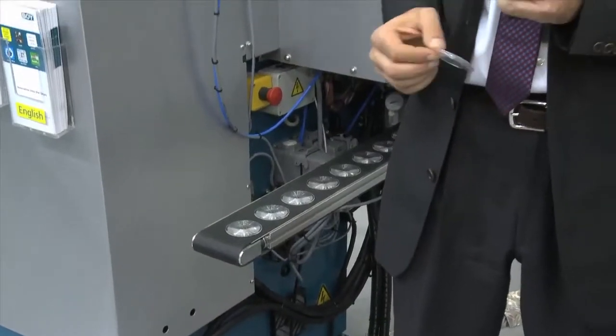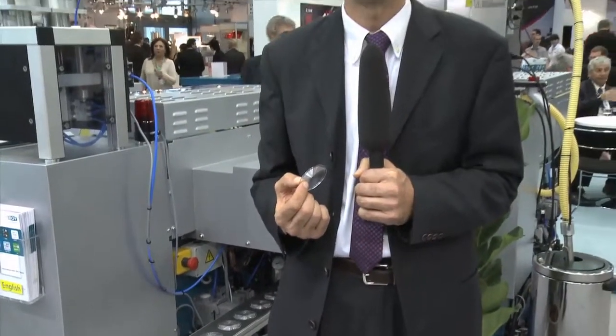On this machine, we demonstrate the processing of ultra transparent liquid silicone rubber. This new series is made especially for optical applications. The advantages are very short cycle times and perfect heat stability. This enables delivery of the material for new kinds of applications, mainly in the lighting industry — automotive headlamps and optical lamps for consumer goods. This material is definitely a candidate to replace PMMAs or polycarbonates, because of the very outstanding properties of this material.